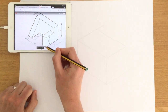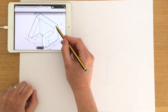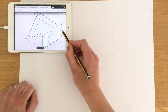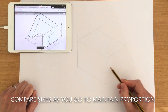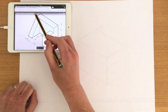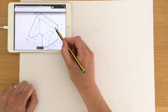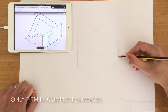Now I want to mark on some of the other sizes and subtract the overall shape from this box. I'm looking at sizes of 40, 25, and 45 to find where all the smaller parts feature. I look at 40 first — it's about two thirds of the overall 60 height — measuring that up on the front line, then sloping back parallel at 30 degrees. The 25 carries all the way to the front, so I mark that on the top line and sketch down, giving me the outline of the front right surface.